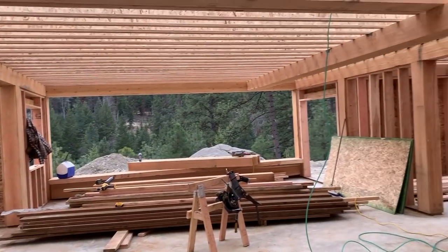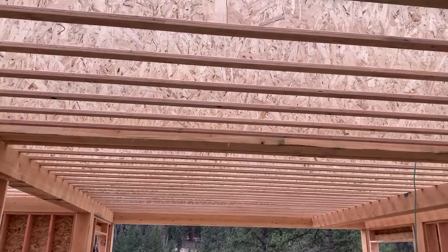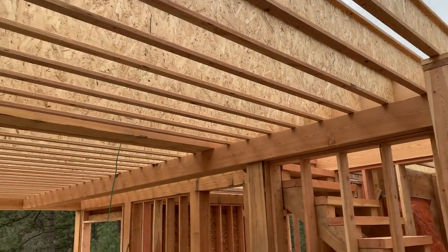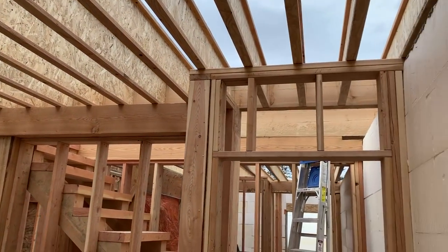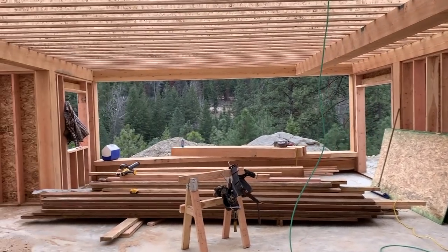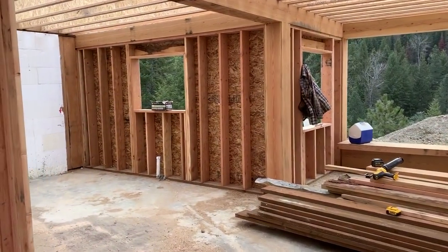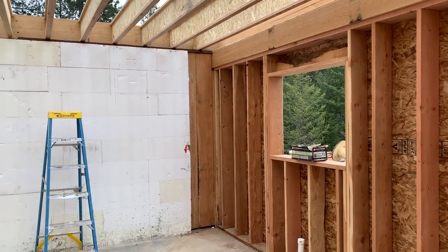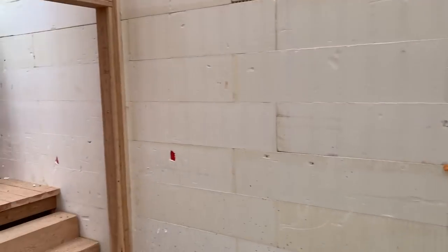This is the center room in the basement — it'll be all open, 22 feet wide. We span this with 11 and 7/8-inch BCIs, 12 inches on center. Those are strong enough to span 22 feet, but we shortened the span with that timber for the stair framing. This is the center area where we'll have a place for youth and people to gather and play. This will be our kitchen for meat preparation and canning. There's a bathroom and laundry in here too.